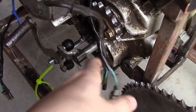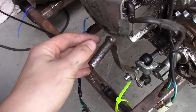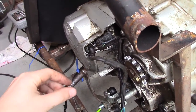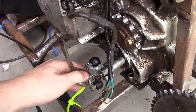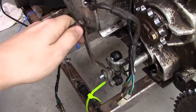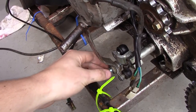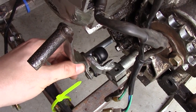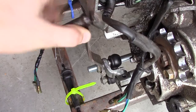So this is the shifting shaft and it's got this little linkage on here. I believe this is what more or less was on the bike to begin with — this pedal that has this little linkage here. But I think the best way to do it was to move it out here like this, so I can get a cable coming from this way, a cable coming from that way, and I'll be able to move back and forth. I just welded a bolt on to the engine frame mount, so when you slide the engine back and forth this won't move — this will move with it, which is what I want. You'll be able to shift this with a cable attached up here. I'm going to modify this pedal a little bit so it will take a cable from both sides, and on this bolt I'm simply going to weld in a little nut on this side so it doesn't move around so much, then put a lock nut on the other side to keep it in place.